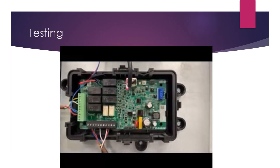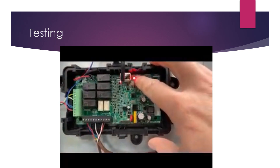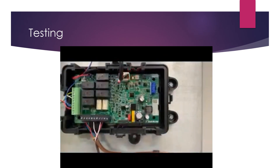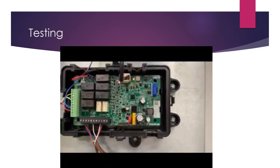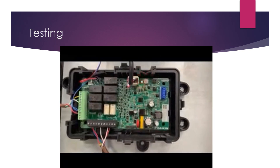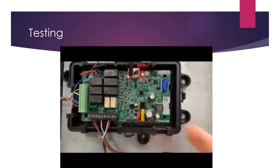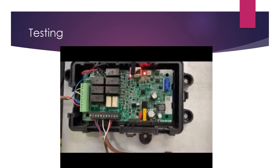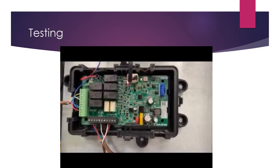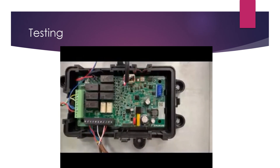In order to test the function of the Dragonfly adapter, we simply push the white button two times and you will hear a click. The red light will start flashing rapidly and we will go into mitigation mode. This will then cut power to the black connector that controls all of our other functions of the equipment and will energize the fan on the green connector. Once this test mode has been completed, we will go back to normal operation.